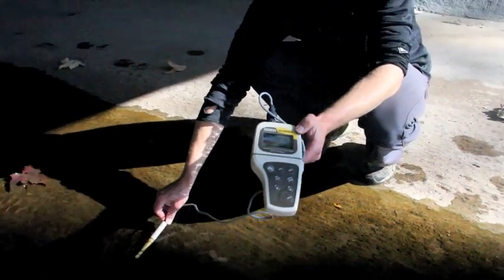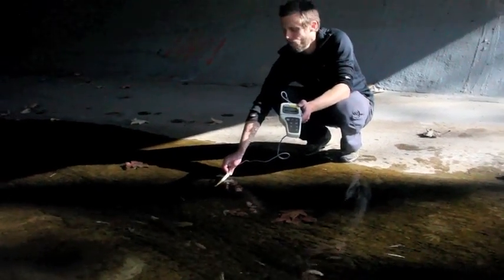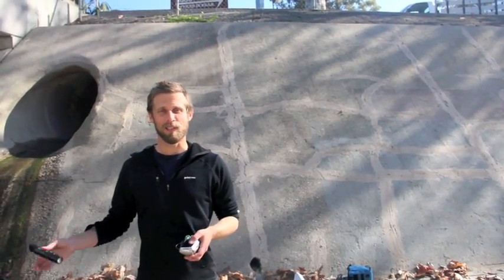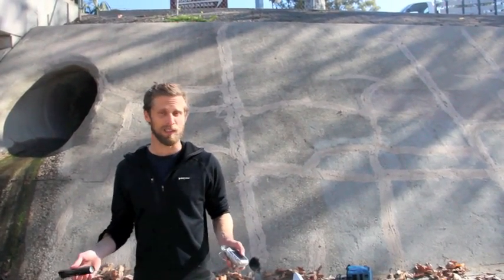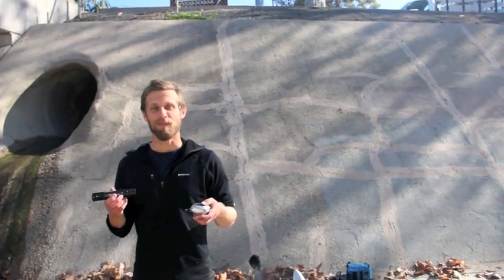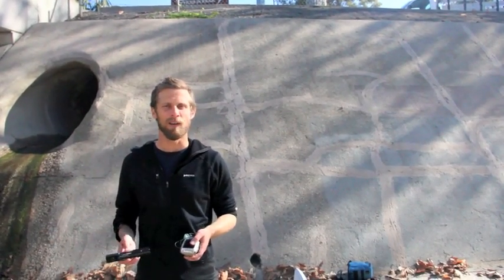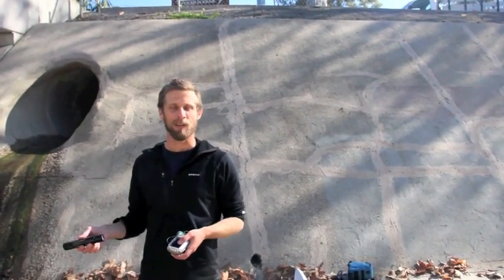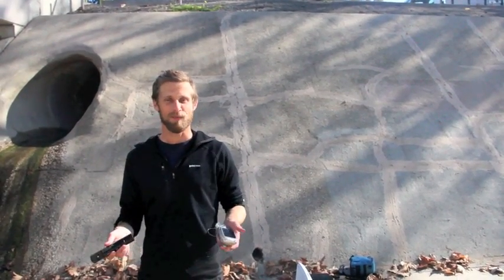So the pipe is around 19 millisiemens and we're at 1.9 upstream. We didn't actually know that this pipe was going to be flowing when we came out today — we basically just got lucky. And that's how this works. This is an intermittent discharge. A lot of these things we try to monitor, it's hard to be here when it's actually happening. It's not like they send us a schedule saying we're going to be discharging — come out and sample it, please.